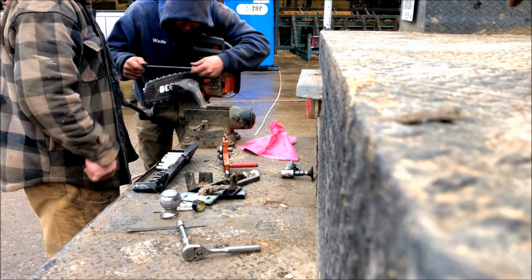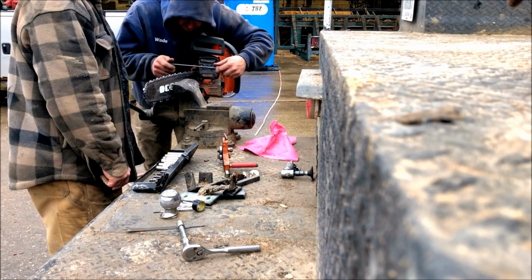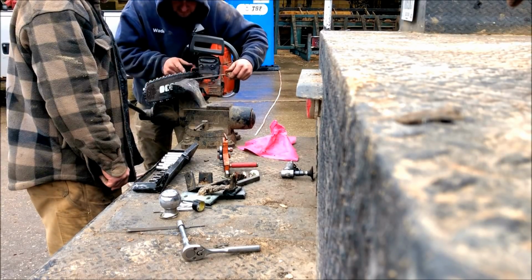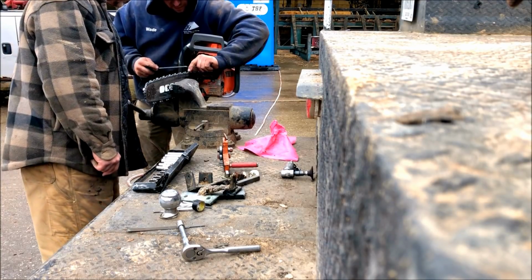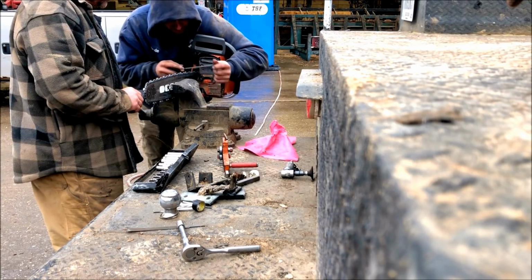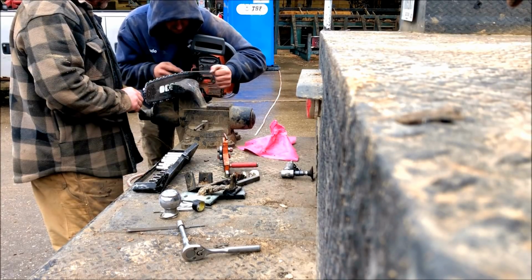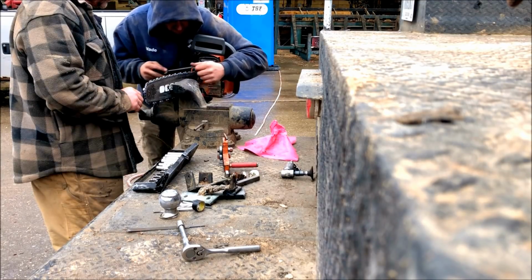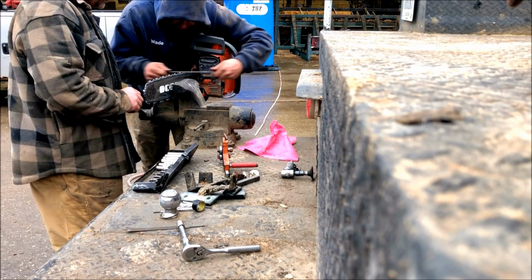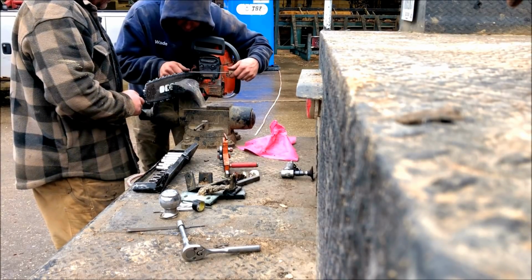See, like now the tooth's done. I'm just trying to get that son of a bitch to where it went. And if you watch, you'll get kind of waves across it. That's why them last few strokes are light, and try to be more precise with them, you know. In the beginning, you're eating, and in the end, you're just cleaning up, you know. That's pretty bad. See, now the filing's done.